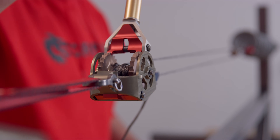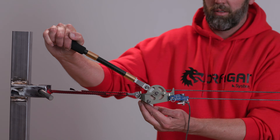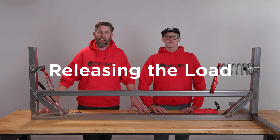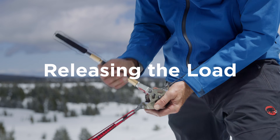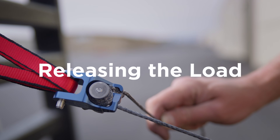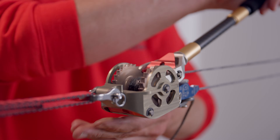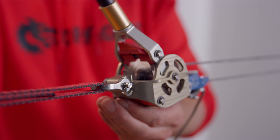When you're done pulling, it's time to release the load. Let's walk through how to release a load safely. You've got two options here: a handle release for heavier loads in small, controlled increments, or a Capio release, which is recommended for loads under 350 pounds. Let's start with the handle release. The handle release is a progressive process where the load is walked out incrementally using the crank.